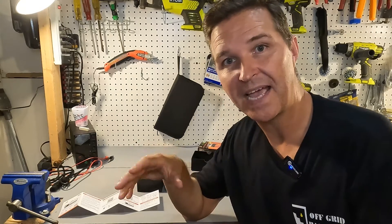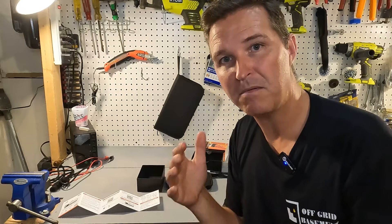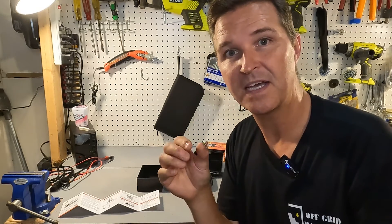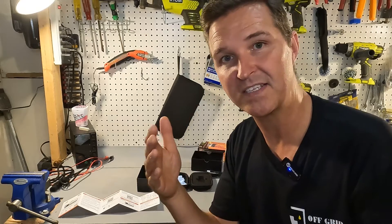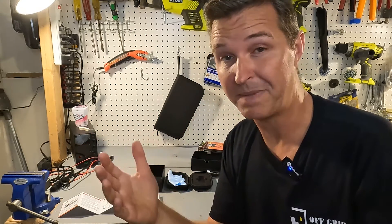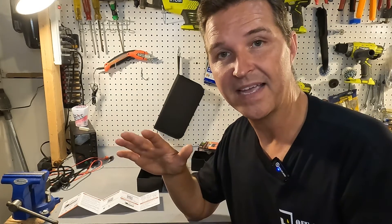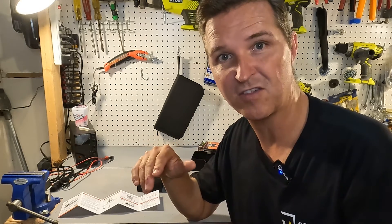The real reason I wanted a thermal imaging camera review on this channel is that you've probably seen me use a different thermal camera. I believe thermal cameras are the best way to find hot spots in the devices you're using when connecting batteries to inverters or solar charge controllers to batteries. You can feel around, but it's a lot easier to just look at your setup and see if there is a hot spot on one of your connections. Let's go ahead and check that out now.